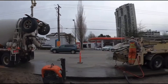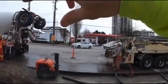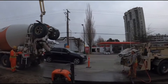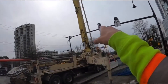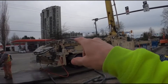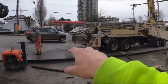He's going to pump this all the way back into the mixer, and then we come down to suck the sponge back. We'll put a handful of sugar in the elbow with some water and suck that back too, so that all the concrete in our material cylinders, s-tube, and swing gate has also been killed with sugar. With the hopper being as low as it is, there's no possible way that concrete in the hopper is going to work its way all the way through the boom and out the end of the taper into the mixer. The stuff in the pump that's been killed with sugar will maybe work its way up into the turret but that's about as far as it'll go.